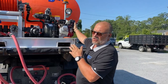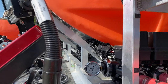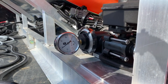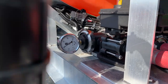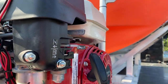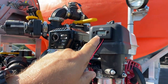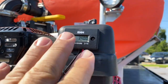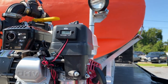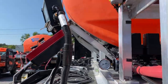Now that we have the motor running, we want to adjust our throttle to get our pressure gauge to 40 PSI. If you look at the RPM meter right here, we're at 3,350 RPM. If you set it there, most likely you will be at your 40 PSI and she's ready to spray.